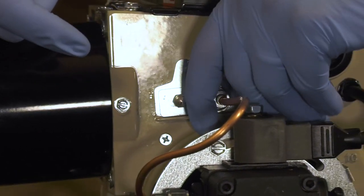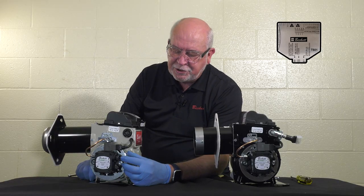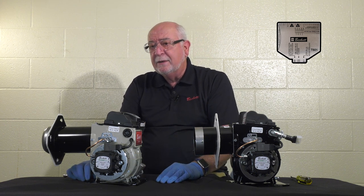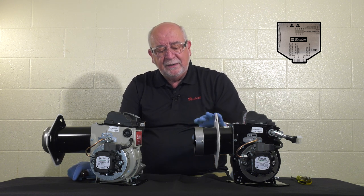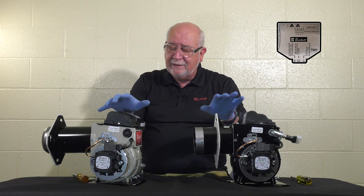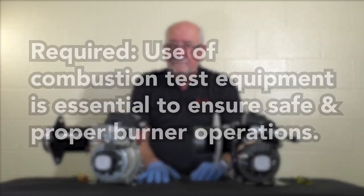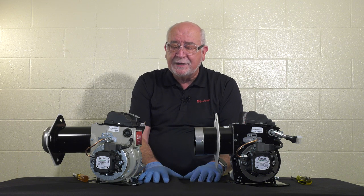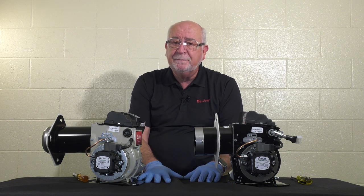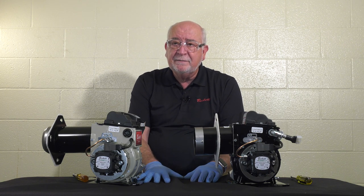Tighten up the spline nut. Now commission the burner and make adjustments with the shutter and band until it is set up for the proper efficiency. The same steps hold true with the L head. Once completed, set the burners up using combustion efficiency equipment. When finished, record all of your information, clean up the area, and make certain that it cycles through on safety.